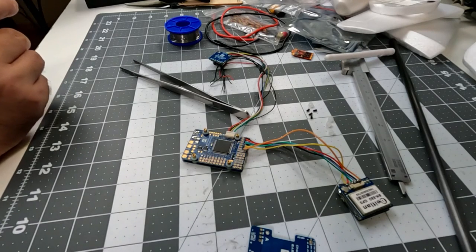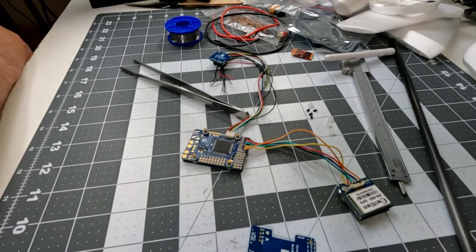And I'm using this temperature for, I don't know, 20 years, maybe not forever, let's say 10 years, 350 Celsius, slightly below 700 Fahrenheit, and it's working just fine. So I think this is a good compromise between everything. And if you don't know which temperature you should use, go with 350. You should be happy with the results. Yes, you have to solder for slightly shorter, but I don't think this is a problem.